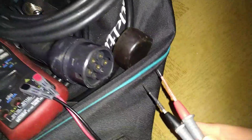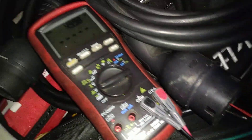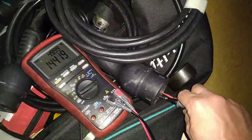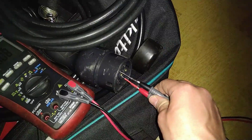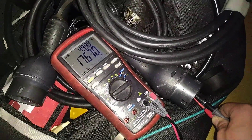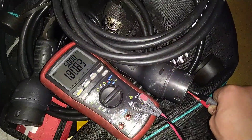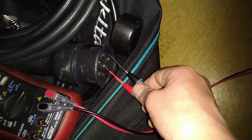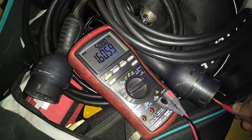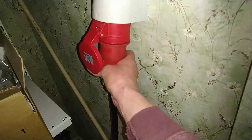If we do the same measurement: ground to live 1 — 14 volts. That's a lot, but it's not gonna kill you. Ground to live 2 — 177 volts on the EVSE car connector. The charger is not enabled, which is good I guess, but that's 177 volts. This is supposed to be nothing — it's turned off. And line 3 — 160 volts. So this thing is leaking — God knows how much — straight from the three-phase plug to the car connector.